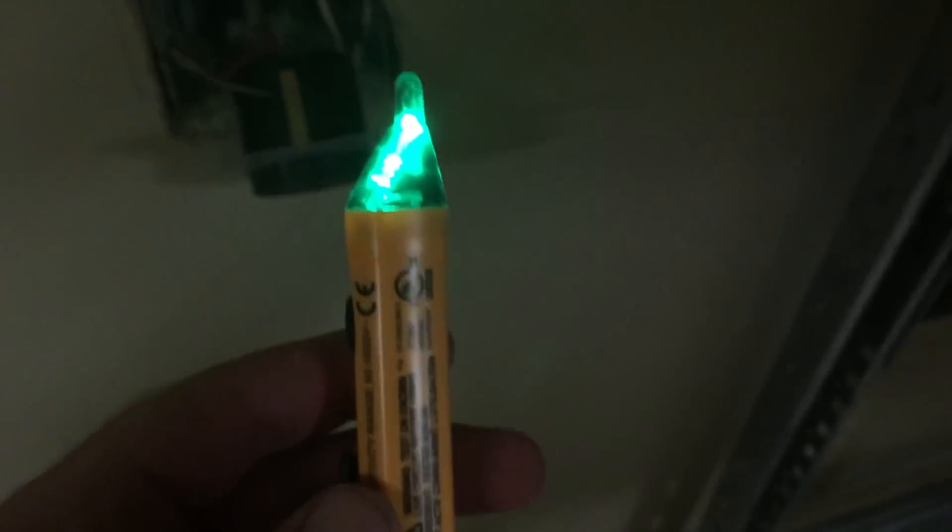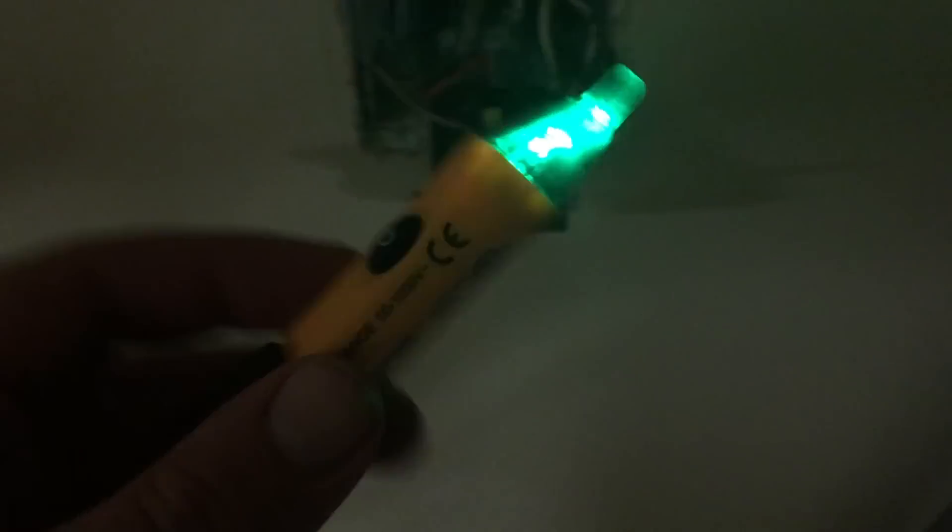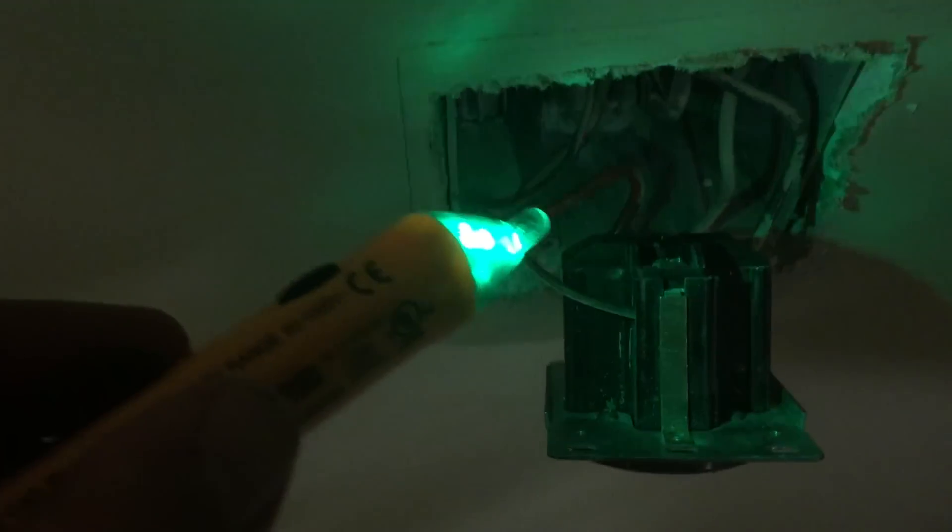Just for visual reference, I'm gonna show you how this works. I went ahead and flipped the breaker on to show you — this will tell you if there is power. There is power to that one and there is power to that one. If you're familiar with how these newer ones work, like a dryer cord, you have 220 which is your red and black, and white is your neutral. An appliance that has 220 and 110 like a dryer would draw between the red and the white — your neutral and hot. Whereas a welder only has a ground and a red and black, or in the case of that welder, it's a black and white for just a 220.